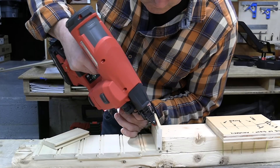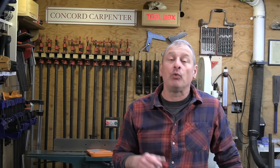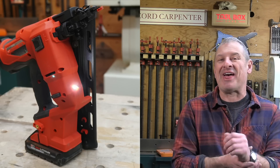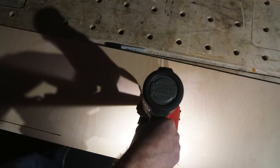If you get a jam, it's as simple as unlatching the jam latch at the top of the tool, pulling the clip out, and taking the battery out. The LED turns on with a trigger pull even without the bracket engaged, giving you the ability to light up your work area before placing your nail. The LED light is located on the right side of the tool — it's bright, but it casts a shadow on the left side, which as a right-handed user is the side I mostly use. Unfortunately, there's just no space on the nailer to add an LED on the other side.